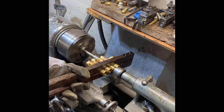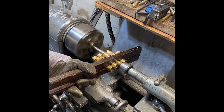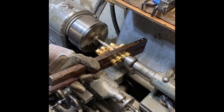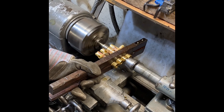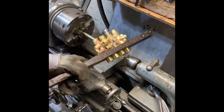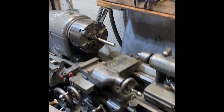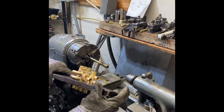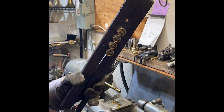The handle I'm using is just made of oak, held in place by a copper strap, and it gives me the ability to hold onto the valve set as I'm doing this step. In the industry, every manufacturer does this differently — a lot of them use CNC or milling machines, but that's not what I'm doing. The second step, after the hole saw has cleaned out the inside of the valve set and the knuckles are gone, is to use a reamer.